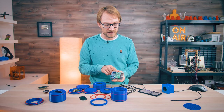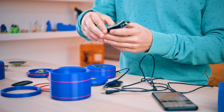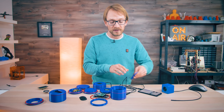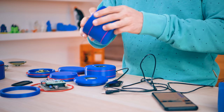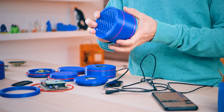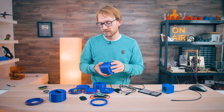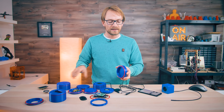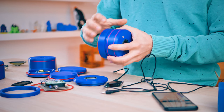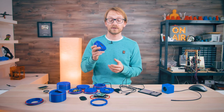I keep showing this board, which is a DSP, an amplifier, and a small buck converter — plus an adapter board. It's too large to fit in here currently, but I've already designed a new PCB that can fit inside and just slot in. For the time being, I've made a grill that can screw into the threads so you can attach your own electronics, batteries, whatever you want. I can also see designing an extender tube that houses a Bluetooth module with buttons on the outside — so when it's assembled as a speaker, you can control it from the outside as one self-contained unit. That would make a really great Bluetooth speaker.